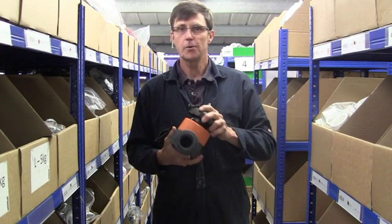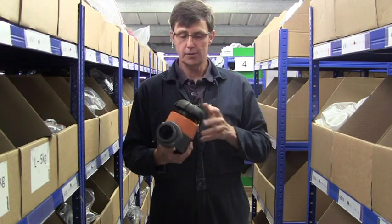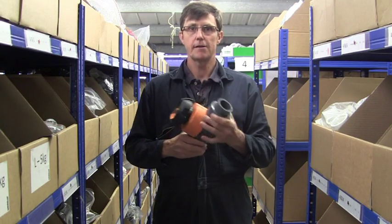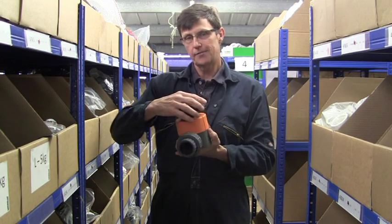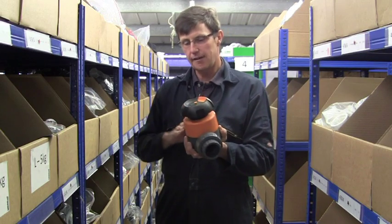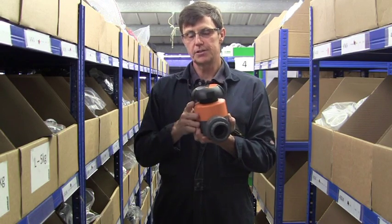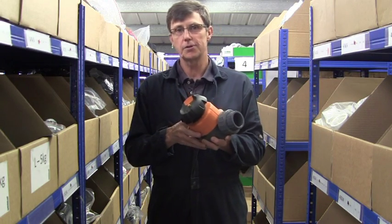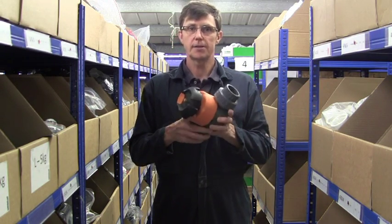The issue with that can be if your water is dirty and there's organic matter in it — like some bits of grass, bits of packaging material, or something like that — and your valve is almost shut, it can very easily block because it's only a very small aperture which the water is passing through. So diaphragm valves are only really suitable for water that's been passed through a strainer or some sort of filter.